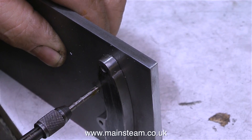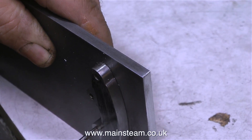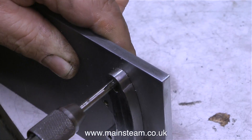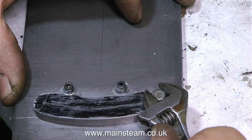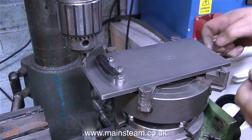In this clip, at very high speed, I am threading the holes — first of all using a 4BA tap, and for lubricant I'm using some of my steam oil and rapeseed oil mixture. And finally, after tapping the larger hole 2BA, I fit the relevant bolts into the holes and tighten them up, and the expansion link blank is now firmly held to the metal plate.